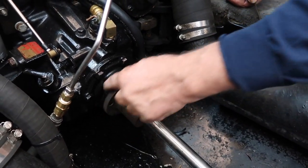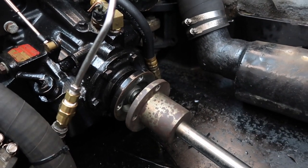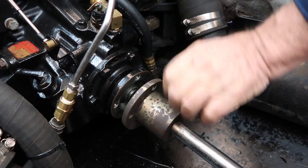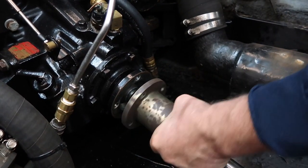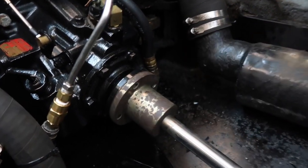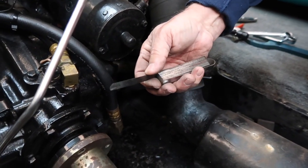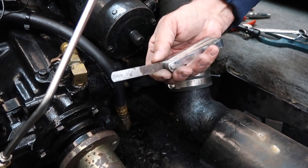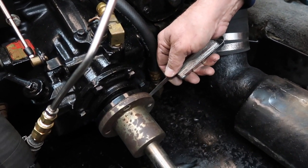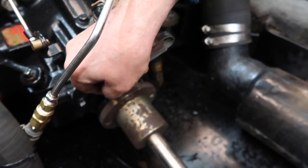As you can see, we've got all our bolts out, so we just pulled the drive shaft coupler back from the transmission. Now we're going to slide them back together again and make sure they intersect properly. We're going to take our three-thousandths of an inch feeler gauge — you can get these at any automotive store — and we're just going to go between these two.